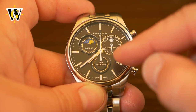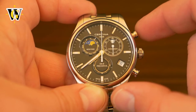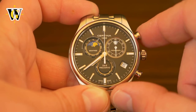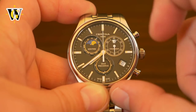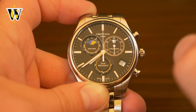When you want to set up the minute hand and the disc — they're actually connected — you have to press the upper button, because that toggles between the seconds hand and the minutes and hour disc. When you press it and nothing moves, it means you're now setting the minutes/disc. Press it again, the seconds hand moves — so now you're setting the seconds. Press it again, nothing moves — you'll be setting the minute and disc.